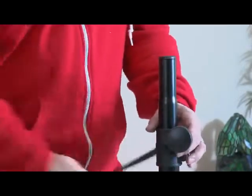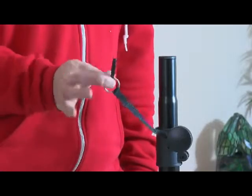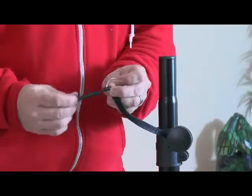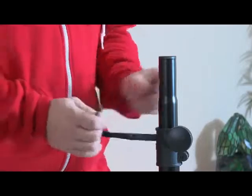Here's a close-up of the stand — the top of the stand — and this is the pin that you put in the stand to hold it at certain heights. This groove and this groove lock in to the clamping ring of the stand, so when there's weight on it, that pin cannot come out.